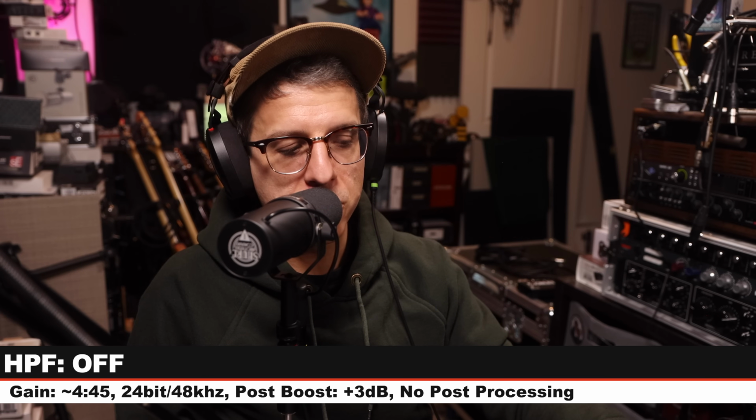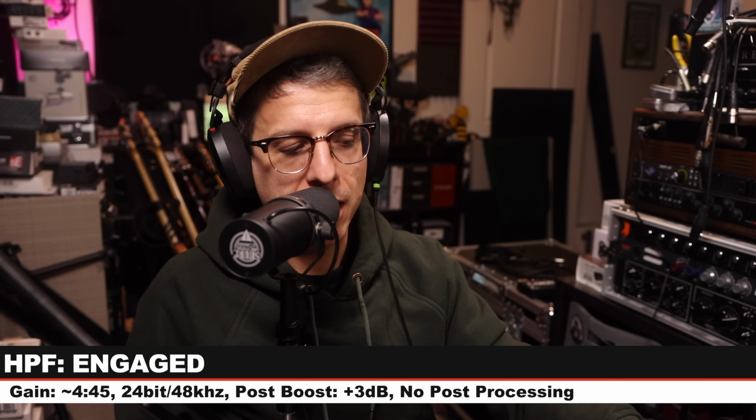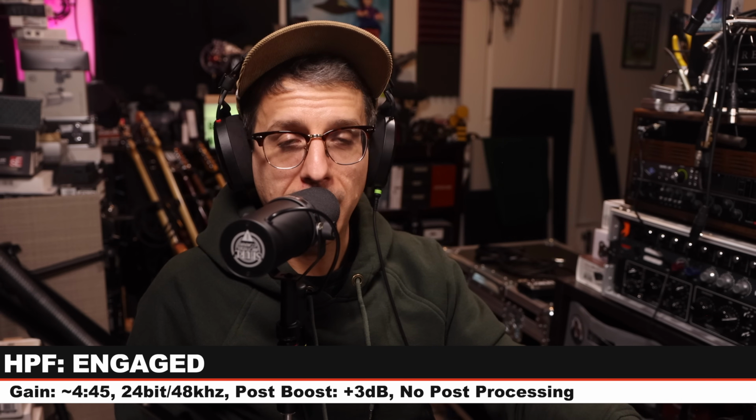I will go ahead and shut off the 80 Hz high pass filter again. You can hear that body, that weight come back. And now I have switched on the 80 Hz again, and here is how it sounds with that high pass filter engaged. Next, we have the music test. I'm going to run some drum samples, some acoustic, some electric, and some DI bass through this thing so you can hear how it sounds compared to the Focusrite.